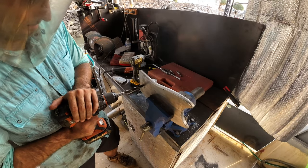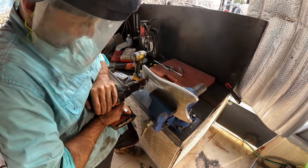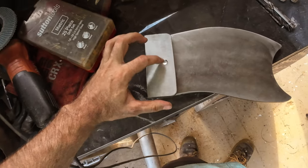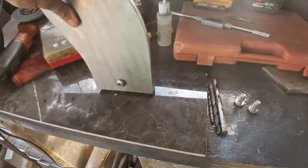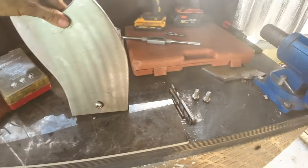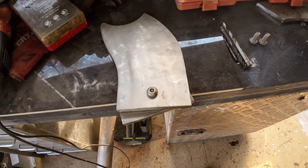Lovely. And then finally I drill a 12mm clearance hole on the stripper side, and countersink both sides. Bolts on the back there, you can see. Turn that over. That bolt comes all the way through, it's not fully tight yet. I'll Loctite those in. That'll weld onto the deck like that, and then this bolts to it. So time to get two more of these Allen key cap screws popped in there, and that's going to hold it nicely onto the deck.